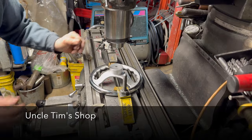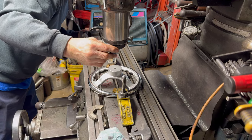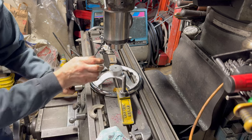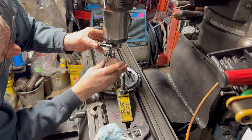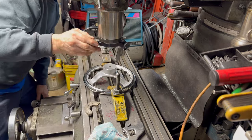We look here, we got plus 3, and over here we got plus 8, so we're going to have plus 4. Go back that way, and it should be plus 4 this way too then. And now you can re-zero your indicator and check it again. Zero, zero, zero. Okay.